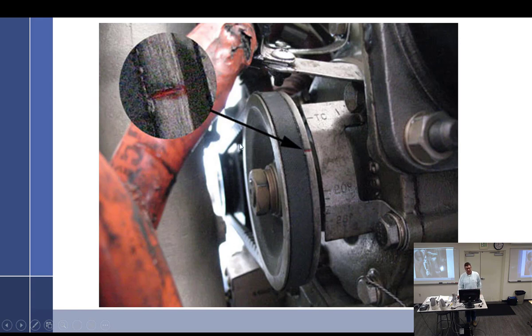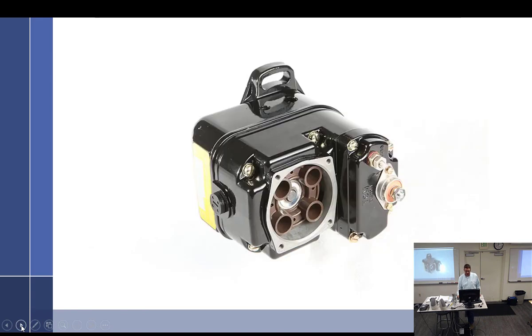Then you got the Permold. They could have just said the one that has the internal driven alternator. Like, oh, internal driven. No, they want to be real fancy about that. So if you look at a Permold engine, it's going to look like three cylinders and a smaller one. Without anything on, we go cylinder, cylinder, cylinder, alternator. They all bolt on kind of the same. The other side's got three. All right, but Lycomings are all with the starter ring gear support.